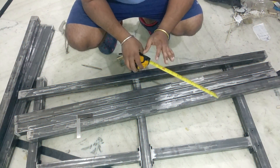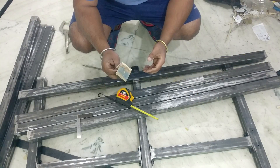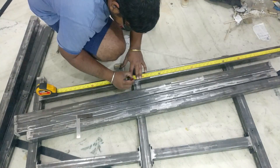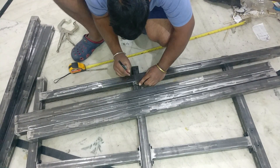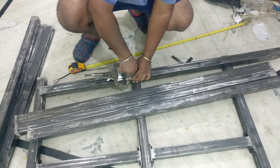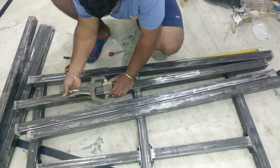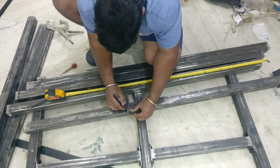I place the bed onto the leg assembly. I need to drill a series of holes so that I can fasten two-by-two angle iron onto them, and the bed is going to be placed over those angle irons and also fastened from the bottom. To mark the hole location, I measure from the top of the leg and make a mark at 37 inches, then place the jig over that line, mark the hole location with a center punch, drill out the holes, tap them, and they are ready to be fitted.